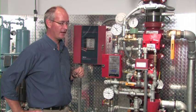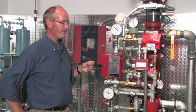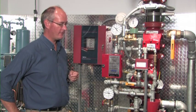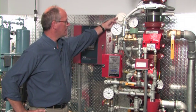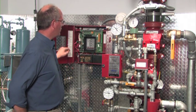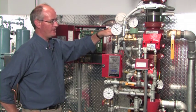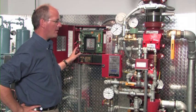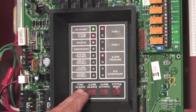The system can only be reset by closing the control valve, draining the system, resetting the release system, and then opening the control valve. To activate the system, the detection must operate. Then through a release control panel, the detection tells the panel to power open the solenoid valve. Once the release system is activated, the panel will power open the solenoid, and a piezo sound is generally made from the panel.